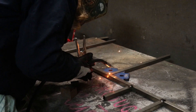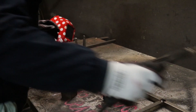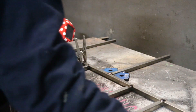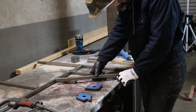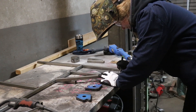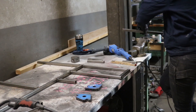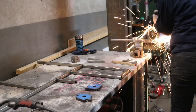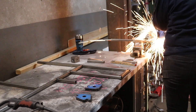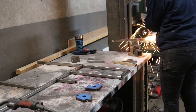The welding magnets don't stick to stainless steel, but I used them anyway to get the right angles. For the angled pieces, I cut a rough length and then simply laid it on top of the frame to draw the angles and the length I needed. Theoretically I could have done the math, but since the frame will deform during the welding, this is a safer bet. And even if I did know the exact angle, I'd still be chopping it off with an angle grinder, so it would never be that precise anyway.